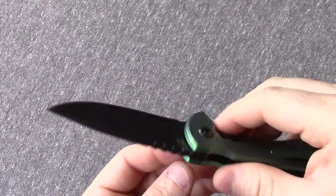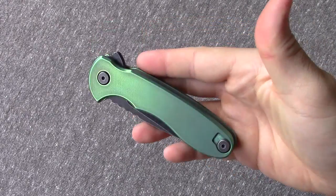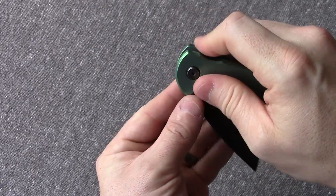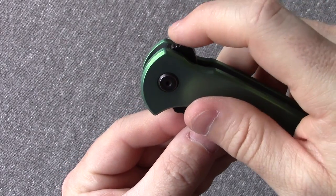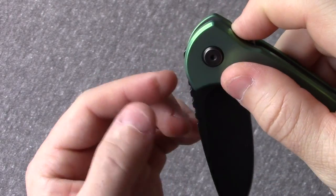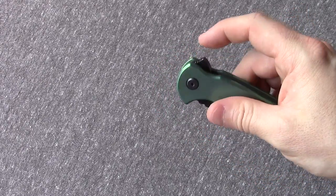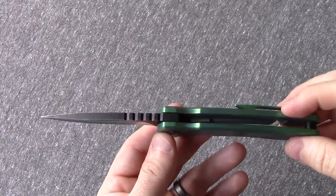The first thing I noticed was the flipping action on this knife. Aside from the blemish, which I was able to fix by refinishing it, I noticed that the detent is really, really weak on this knife. I can barely push it out. So you really have to button-press it and it's got to be just right. The reason why is there's a lot of extra material up here — this isn't a very pronounced flipper. It's just a little triangle and it's really rounded off. So a lot of times your finger won't really release when you're flipping it and it will kind of catch on this part and almost stop the blade from moving. So it's not a very good design for a flipper.